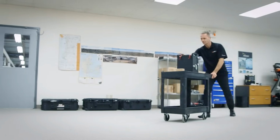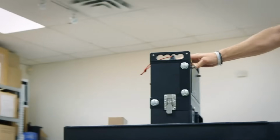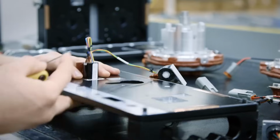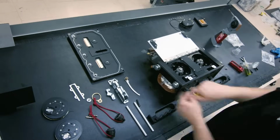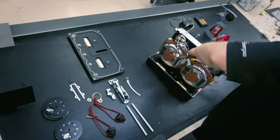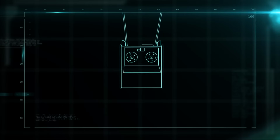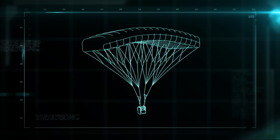The black box, called the Aerial Guidance Unit, consists of two small metal compartments that fit together. The first step is to assemble the upper half, or the muscle of the guidance unit, which contains the basic driving mechanisms and pulley system. The pulley system will tug on the parafoil's lines to steer the Sherpa to its drop zone.